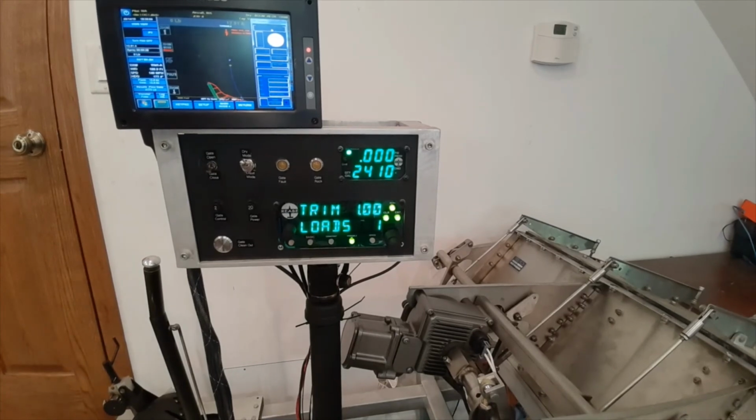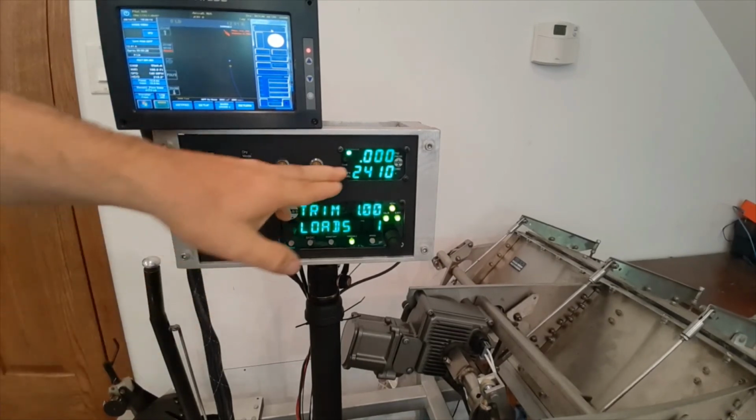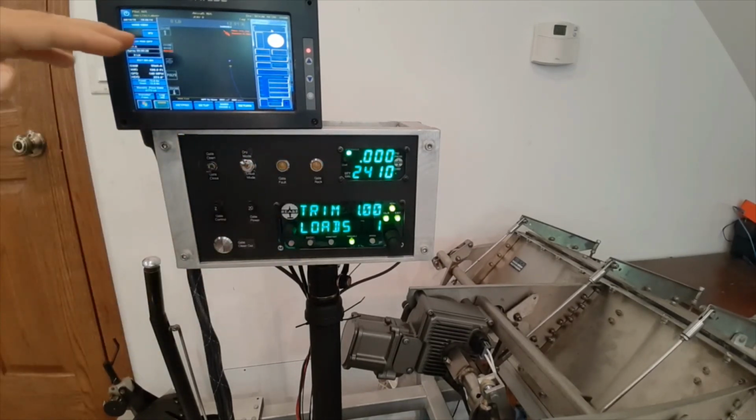Disarm the gate. So that's a short video on how to set up the system for a PMAP. Again, the unit needs to have learned the chemical so that your quantity system is working in order for it to be able to take the pounds per acre information off the PMAP and adequately adjust your gate.